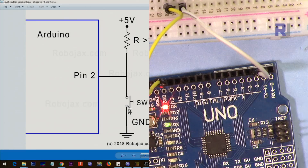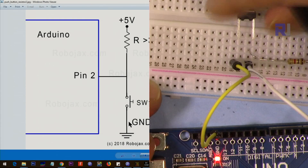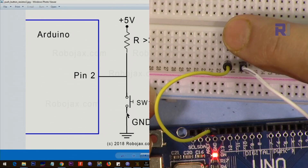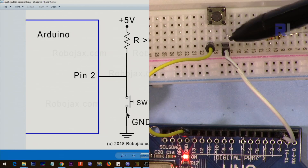From pin 2 there is a push button that goes to ground. The push button has two pins — one is connected here and the other here. The yellow wire is connected to the ground of the Arduino. So when I push this button I'm connecting pin 2 (the white pin) to ground. When I release it, the push button is released and pin 2 is connected via resistor to 5 volts.